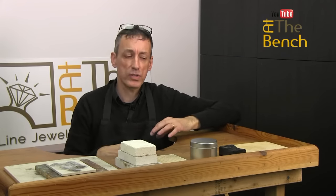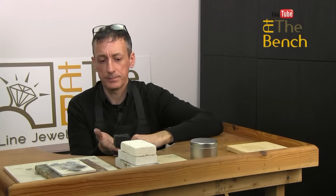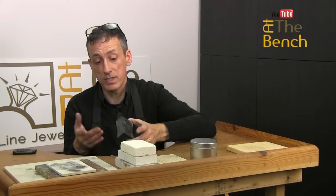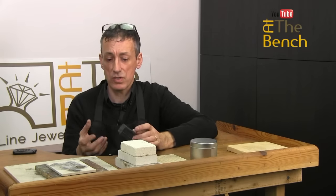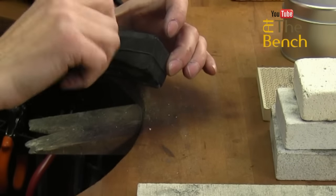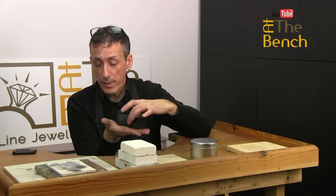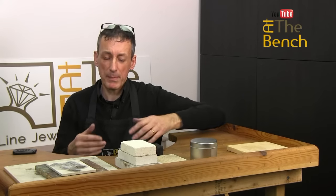For me, one of the best types of blocks — and this is the type of block that was used hundreds of years ago — is a charcoal block. These are basically frowned upon now because trees have to be cut down to make them, as they are obviously burned wood. If you do use one, they are a fantastic surface to solder onto. I would always recommend wrapping iron or stainless steel binding wire around the outside and twisting it to hold it together, because they have a tendency to crack and split when heated up. Or make a little tray from copper or aluminium to hold it neatly. And because it is charcoal, it will mark the bench, so put it on something as well.